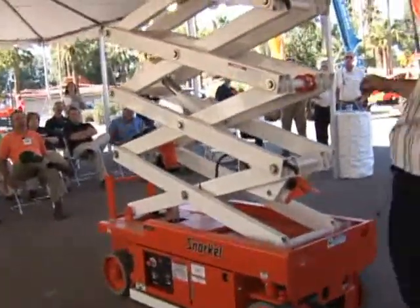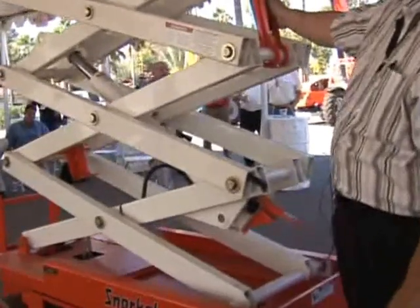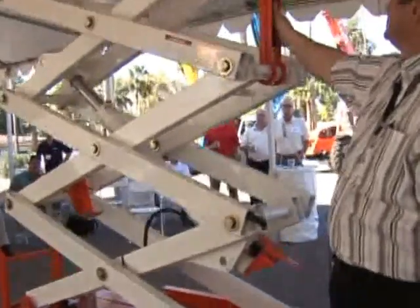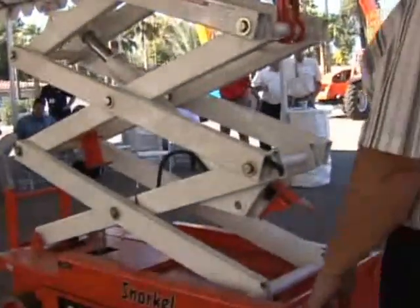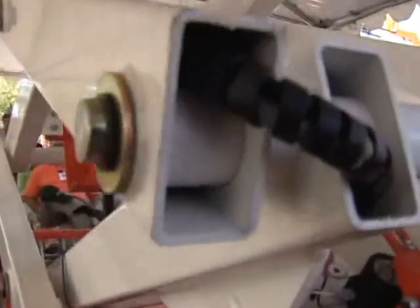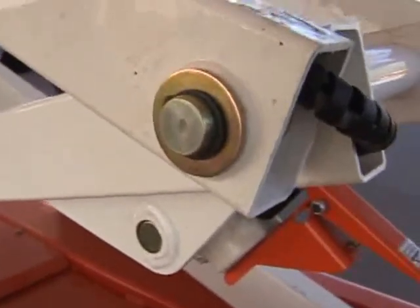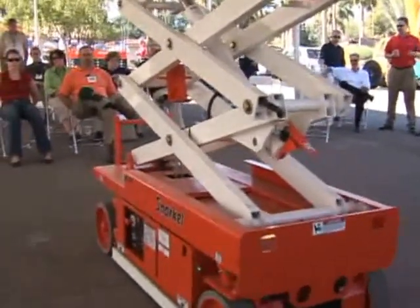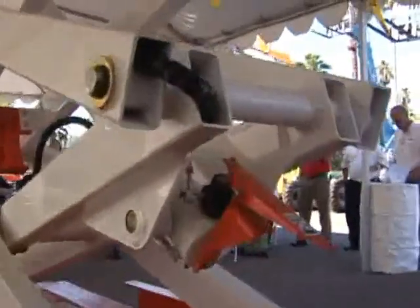As we've all talked about today, we all have our safety bars—self-centering. The box tubing scissor arms have DU bushings, Teflon coated, riding on hardened chrome pins. No maintenance required—Teflon lubricated as stated. There are two grease points on the machine, on the steer pivots only. The emergency down system is a lever system. It also has a physical mechanical stop so that I cannot damage the spool stem.